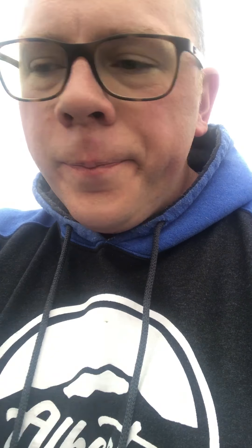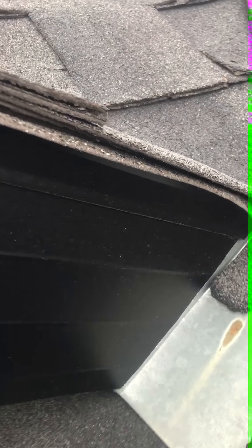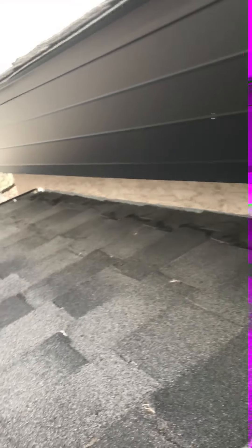There is water staining — I'm not sure exactly why water is getting in behind here, but I know it has something to do with this area, and that is something we definitely need to address while we're up here. You'll also note that nail is driven in at an angle — that's because this space right here is too small to fit an air gun in properly, so people end up gluing in shingles. We have a palm nailer — most roofers don't know what that is; it's a little nailer that fits in the palm of your hand and allows you to get into tight spots like this without having to glue in shingles.